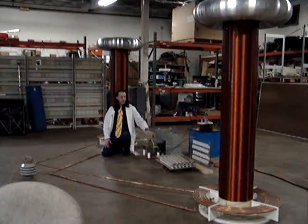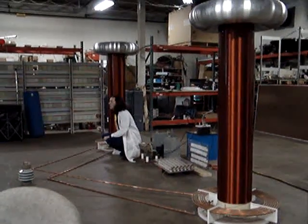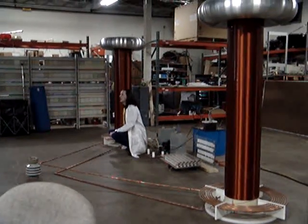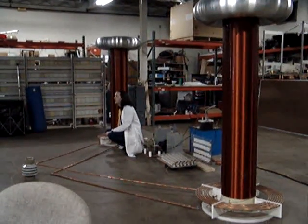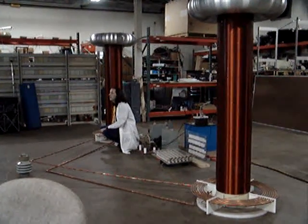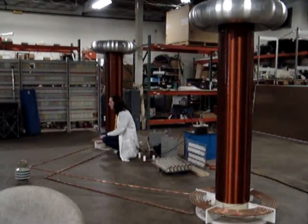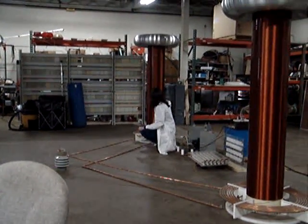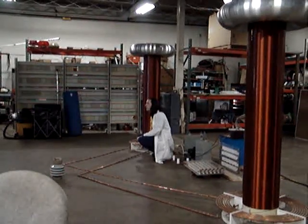When this comes into alignment, all that voltage immediately discharges through these big rings — these are the primary coils of an air core transformer. What that does is this turns into a big electromagnet. And whenever you have wire inside a changing magnetic field, you can induce a voltage here. Even though these two don't touch, the 20,000 volts from here gets pushed into the bottom of this coil. And all this is is thousands of feet of magnet wire wrapped in a big coil around a piece of pipe.